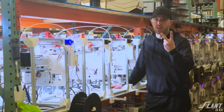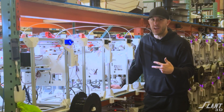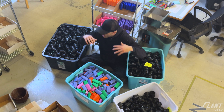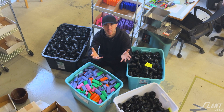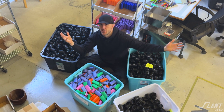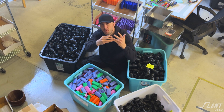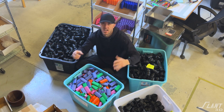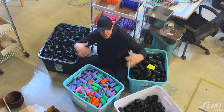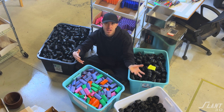There are two main ways of hiring a print farm. The first is buying a big bulk order of parts. The other is having parts printed on demand. The bulk order way is really like using an injection molder that's 3D printing — but you don't have to buy the mold. You get a big batch of parts and store them for assembly. In this case, you go to a manufacturer like Slant 3D and say you need a thousand parts because demand is high and your print farm can't keep up. You provide a file and go through a process — potentially multiple weeks — to verify the design, order samples, get everything set up, and make sure settings match. There is always a transition period and a meshing period where you and the manufacturer need to get on the same page.